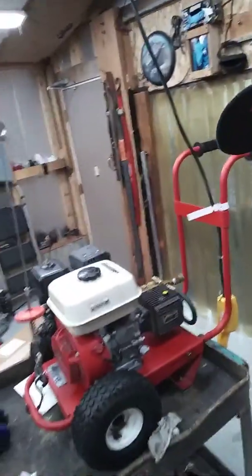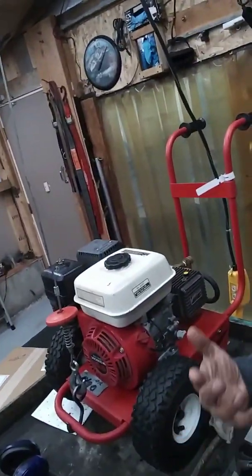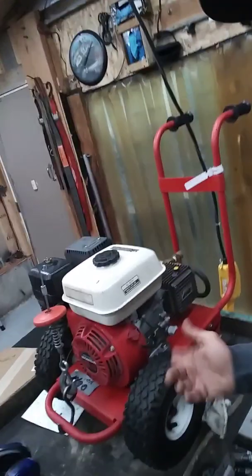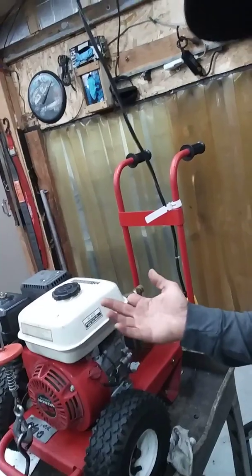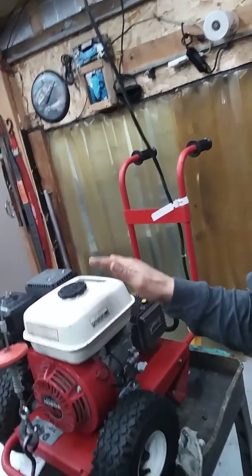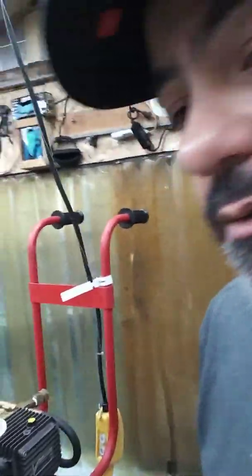So I'll give you an example here, pressure washer wise. We got this little ProJet, and my customer brought this in to some lawnmower shop, and I'm just generalizing here, but some lawnmower shops actually have qualified technicians who work there. Some don't. This one didn't. They did an okay tune-up, meaning that they used pretty decent parts, changed the oil. Theoretically, they ran the machine before they changed the engine oil, which is 100% necessary. They didn't use the correct heat range spark plug, which isn't the end of the world, but they did everything relatively right.